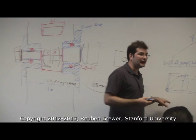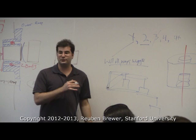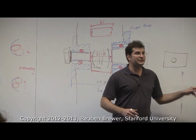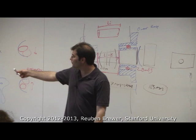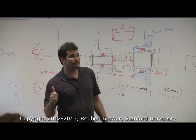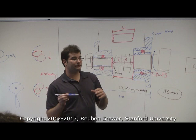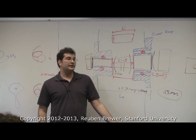Now this hinges on there being a first shaft that never moves with respect to ground. The reason I'm saying this is often you need a shaft that doesn't move with respect to ground, and you need all of the other linkages to move with respect to that grounded shaft. So that's why Keith's question of why don't we just press fit it to one of those doesn't work, because in a lot of very common cases we need that shaft grounded and we need the other two links to move with respect to that ground, that concentric shaft ground. You need the shaft to be grounded. Not in all cases, but in many very practical and everyday mechanisms, yes. And so that's why you need the four bearings.